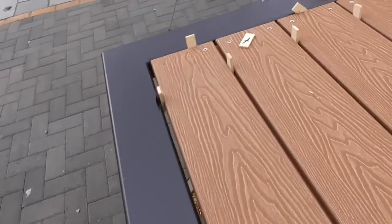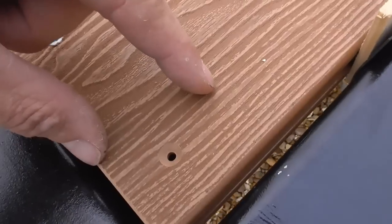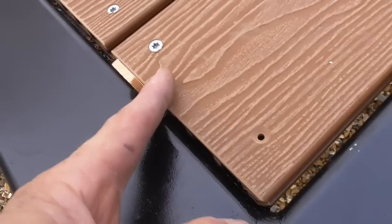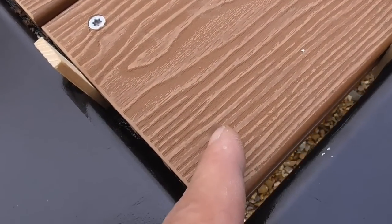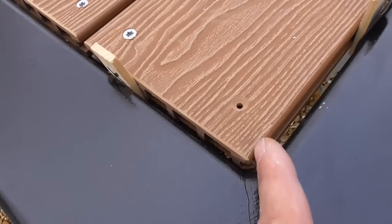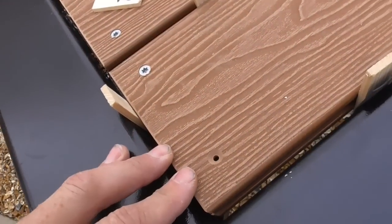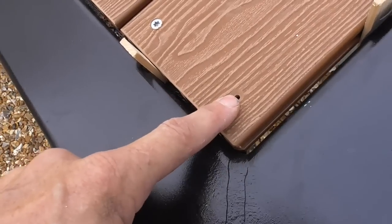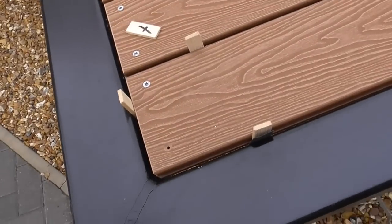And a similar issue up here, as you can just see through the back, there's a diagonal brace. This top plate didn't come all the way through; it was cut into the back of the diagonal brace. So with that screw there, if you take a 45-degree line, I'm not going to drill it because I think it's just going to hit down the side of this 50 by 25. So I'll probably have to put a fake one in there and maybe fix something up from the back. But I'm not that worried. That's a small problem to overcome.